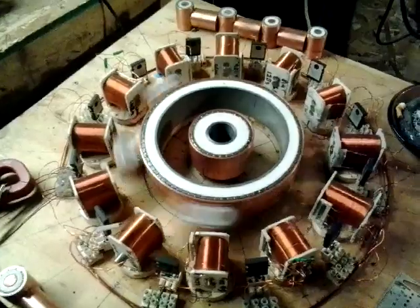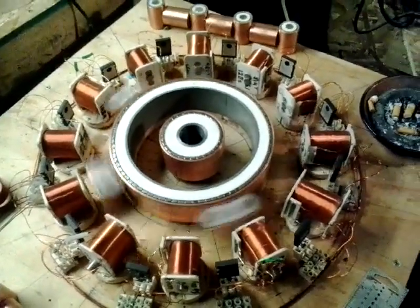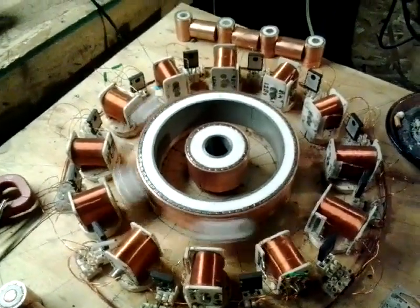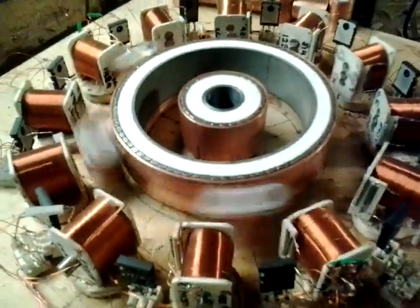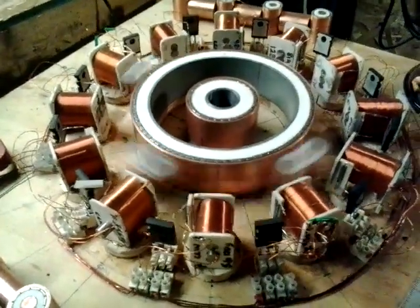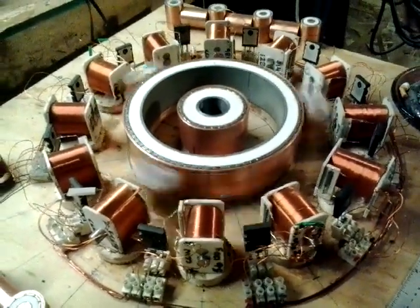Anyway, that's it for now — more to come, things are looking up, things are looking better. Three rollers, twelve volts input, and it is charging a battery using the typical Bedini circuit — just catching the flyback voltage and throwing it into another battery.